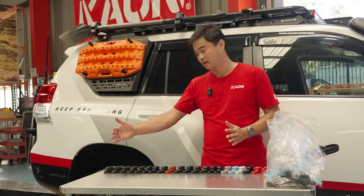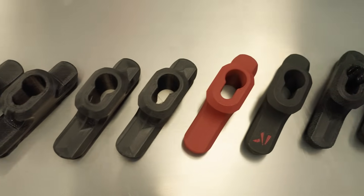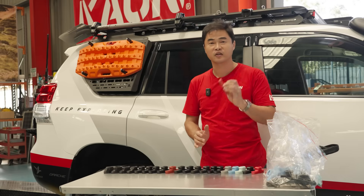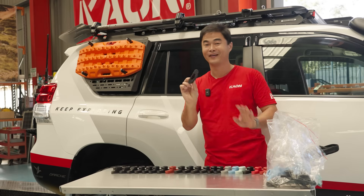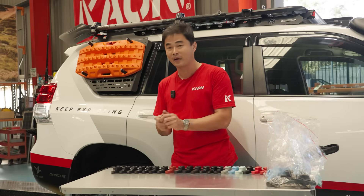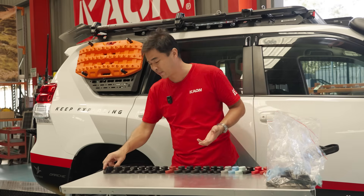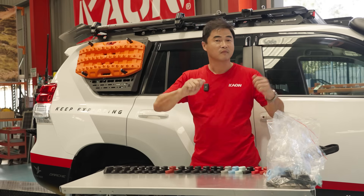You want to make sure that tooling is going to pay for itself over the life of the product. That's why having the opportunity to refine the product first — or at least get it to a stage where you can release it and get some feedback — so you can put those last tweaks in before committing to the tooling to create the injection molded part, that was really useful. I don't think I would have been confident going straight to tooling from version one — that would have been a disaster. It's always better to have something to play with in your hand, to make changes and see how things feel, how you interact with it, and whether it's actually going to solve the problem properly. For me, I like the fact that it clips in place and it's right there — easy to use.